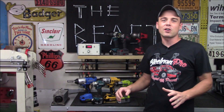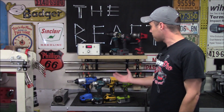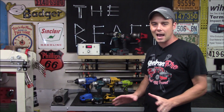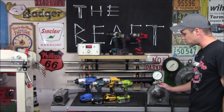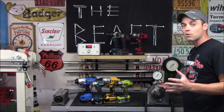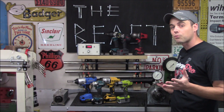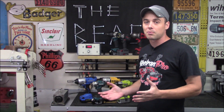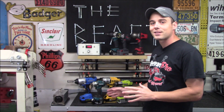Today we're talking about torque testing, specifically torque testing of impact wrenches — cordless, pneumatic, or corded models. Testing them will be exactly the same no matter what version you're using. We'll typically use the bench-mounted Skidmore Wilhelm, or the one mounted in the shop press. These can measure forward and reverse torque, and the number we normally come up with is working torque — that's after 15 seconds of run time and is the maximum that any of these could ever achieve. However, it does not show you the dynamic or instantaneous torque ratings.